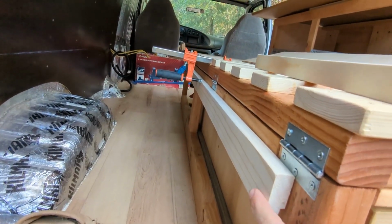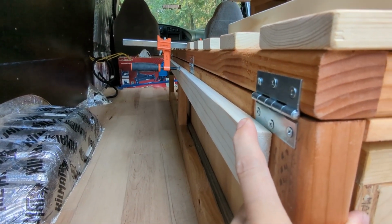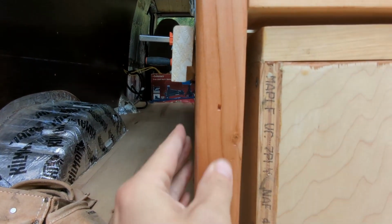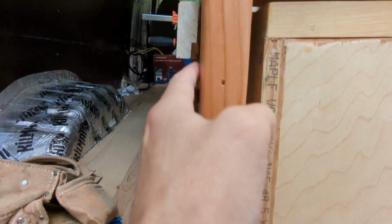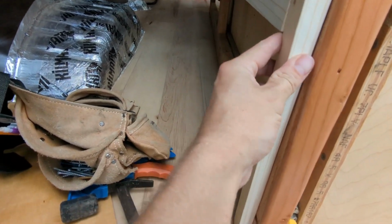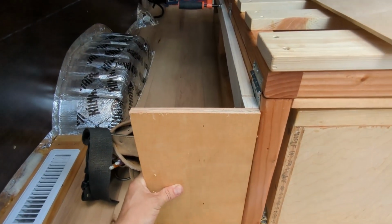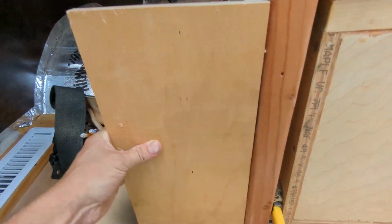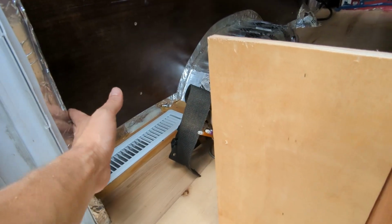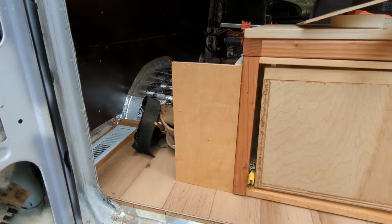So I've got it clamped on there now, and this is just going to fall underneath all of these hinges, and that'll kind of give me my line going down. Here's that little inset where I'll put the actual backer board in, and then I'm just going to use this little piece here. That's going to fall in there, tie in. Once I close up that whole side, that will kind of be my backer piece. This will allow me to hold in this dividing piece to the back, so that'll fall back in there. Just kind of gives it some separation and just more of a cleaner face.